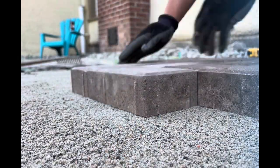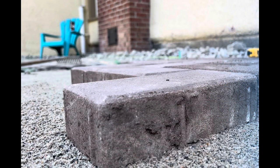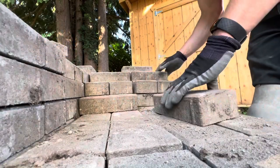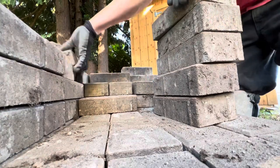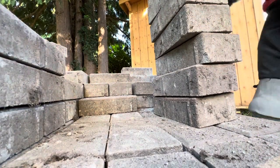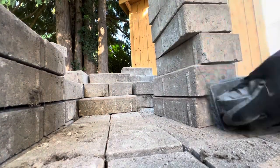This would be a great time to pull the client out and make sure that they're happy with it. I'm using the ICPI recommended click and drop method for actually laying the pavers onto the sand. For this video I really wanted to show you that you can reuse old pavers and still do a really nice job. They're not going to be clean after they're pulled up, so I usually scrape all the joints first before I even pull them up. Makes it nice and easy.